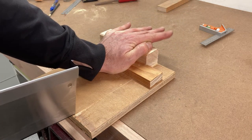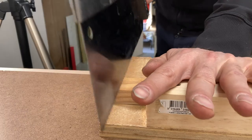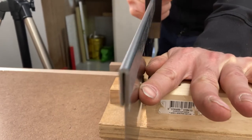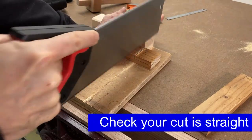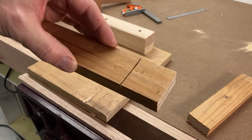You'll still damage your fingers but are less likely to cut them off. This reverse angle shows you that using this method keeps your fingers well away from the teeth and can actually help you to steady the blade. Sorry about the shaky footage but the camera was on the bench. The next thing to watch is that you make a straight cut — it's easy to go off course so stop and check regularly.